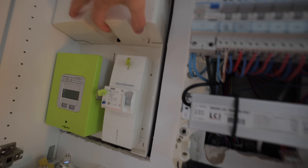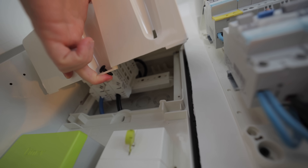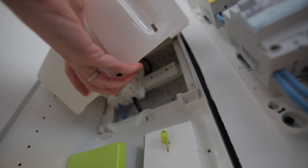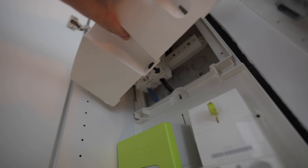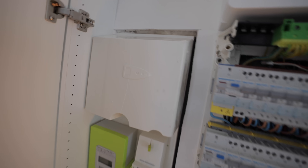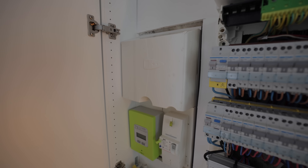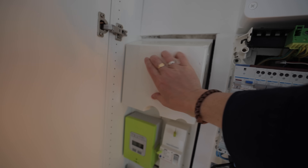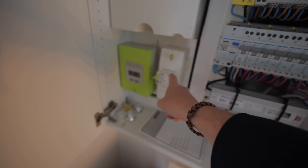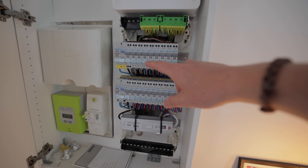Finally, I promised you I'd get this open — and it does just have a switch which we can unscrew. I can't get the top fully off, but I can see some kind of big cable coming in and through. It looks like there's a blade fuse in there — yes, there is a blade fuse, and it's a 40 amp fuse. Now, there's a reason this cover is on — it's to protect you from live parts, so I'm not going to mess around with that too much. I'll show you a picture of a blade fuse on screen. Essentially what's happening is the main supply is coming in from the road through this fuse, then from the fuse into the RCD, from the RCD into the meter — or maybe the other way around through the meter into the RCD — then from the RCD into the main board. That is my summary.